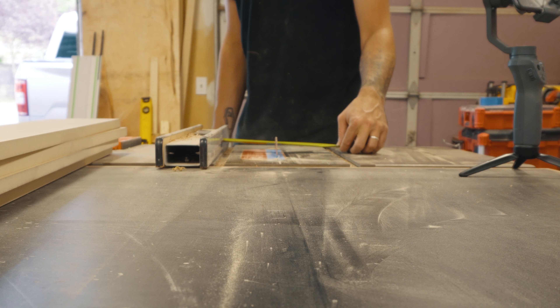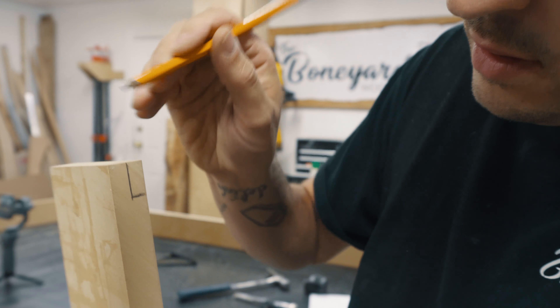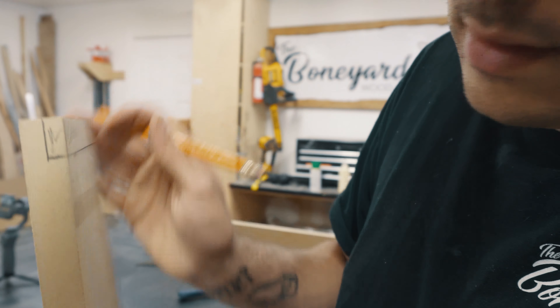For the actual casing, I'm cutting out of a sheet of three-quarter inch MDF that I had kicking around. I basically cut four strips at five and a quarter inches. Once I cut all my four strips to width, I cut the top and bottom pieces to length, minus a quarter of an inch off each measurement. That way I can allow for wiggle room and also make it level if it's slightly out.